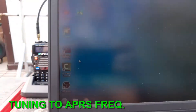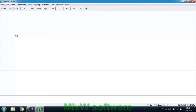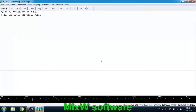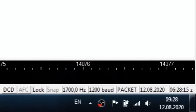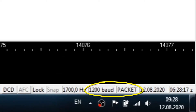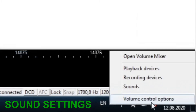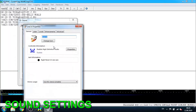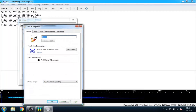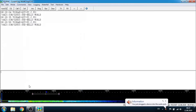The first thing you can do is run digital mode software with your handheld radio and see what digital transmissions are out there. The APRS transmissions are in fact packets at 1200 baud. For things to work out nicely you have to do some sound settings on your computer side — the line-in and volume settings should be around 50% and the audio knob on the radio set to about one quarter to half.